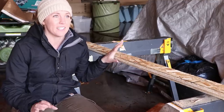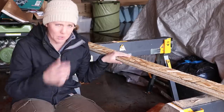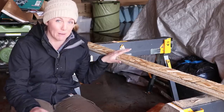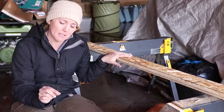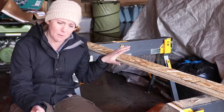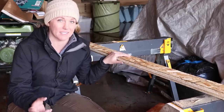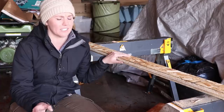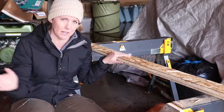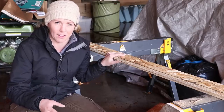So yesterday when we were putting our panels together, we were doing a lot of hitting them with a sledgehammer and a lot of them were just bouncing despite having maybe a quarter inch gap in some of them, which means some of our panels weren't fitting together by say a quarter of an inch. If they're a quarter inch apart each, you would see how it would grow over the length of your wall. Like with anything, we decided to start measuring like crazy.